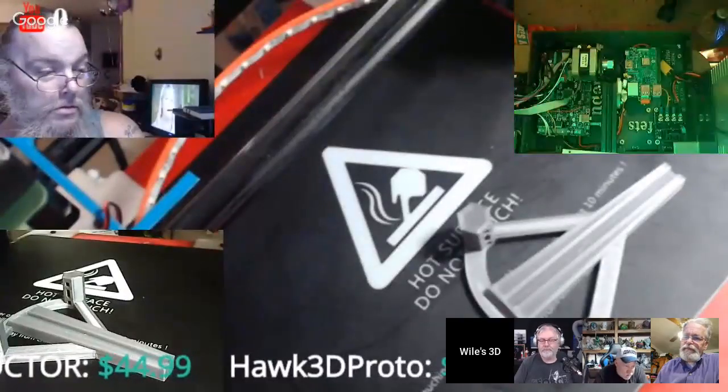Yeah. Over at the shop, we finally got some extension cables in, which were only 1 meter long for the BL Touch. And when I went to put the BL Touch on the CR10S, it didn't reach. I had to actually add another meter, which in reality, all I really had to do was add a 0.5 meter. Yeah. And it would have been okay.